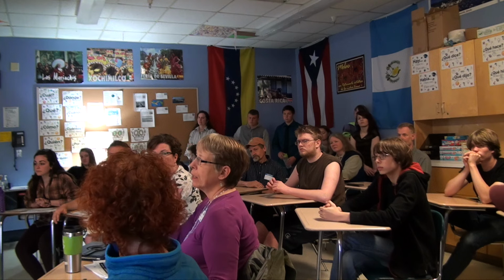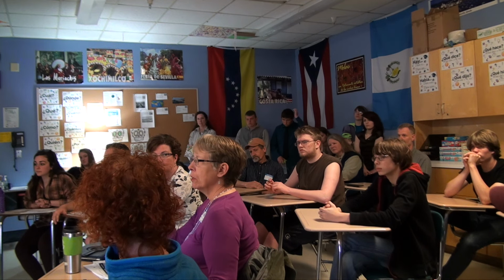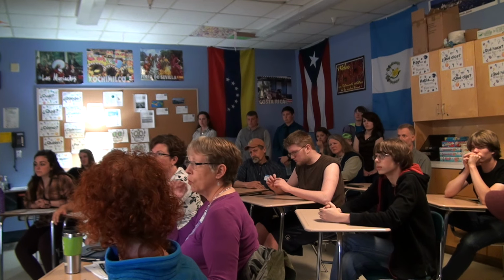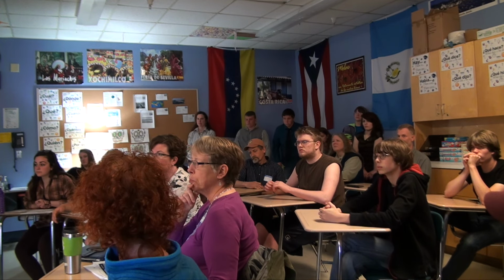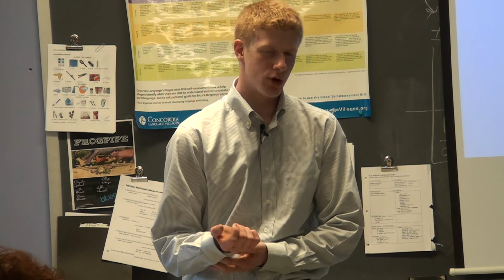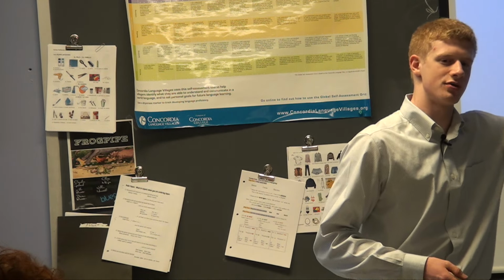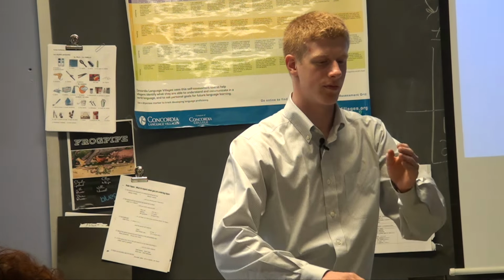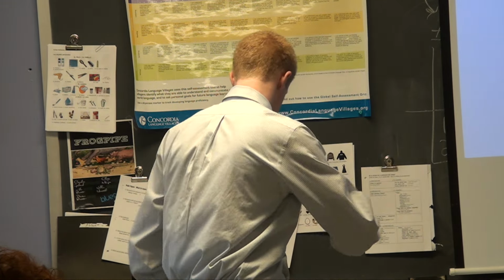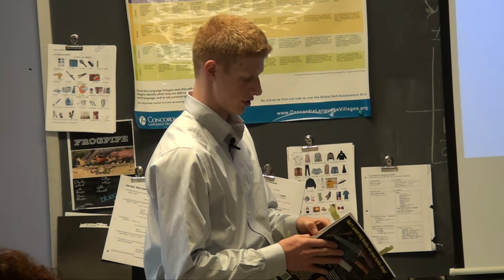Is the color of the metal that you're forging the only thing that you're doing to monitor the heat, or is there some sort of thermal measurement? Actually, most of it is by the color of the metal. Not so much all of the different colors that you saw, but the change between dark red and dazzling white. Okay. I might have a chart thing here.